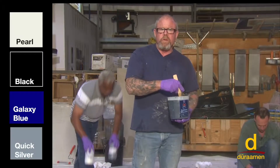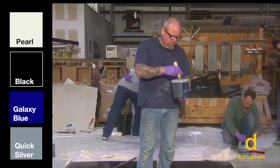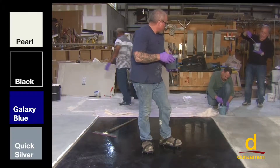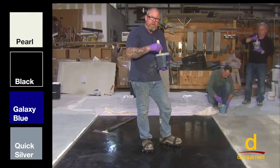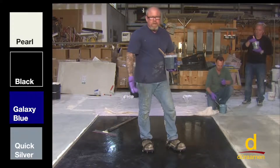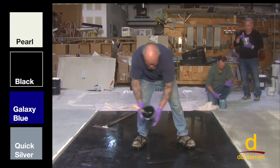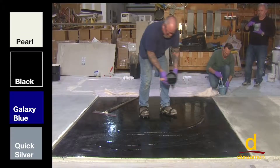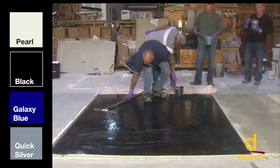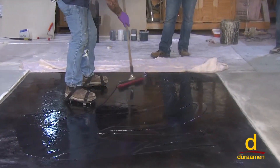There's a variety of ways to install the Lumiere Designer Epoxy. Our base coat is dry — we put that down yesterday. It's black, and now we're working with four different colors. This material mixes at a two-to-one ratio. Make sure you read the technical documents before mixing so you're getting all the proportions correct. We've mixed in the metallic colors. You can pour different colors and use a notch squeegee, or here I'm just going to use a magic trowel and blend the colors in. First thing I'm going to do is just put a tight coat down — very random.